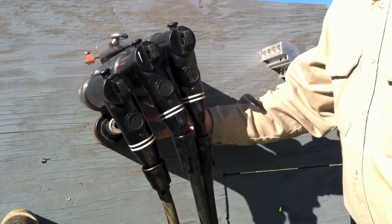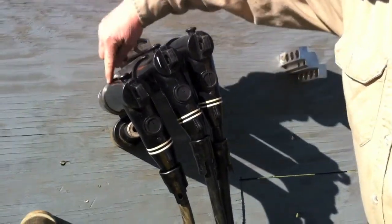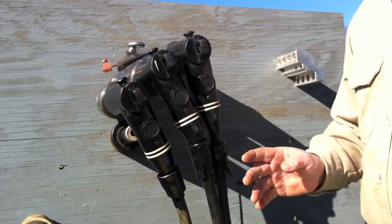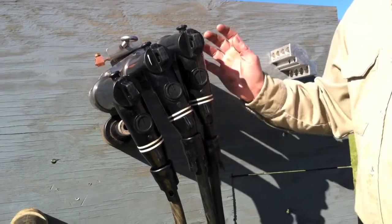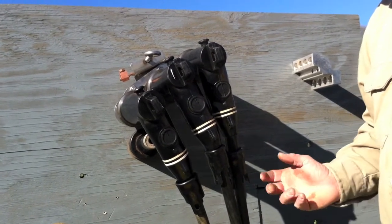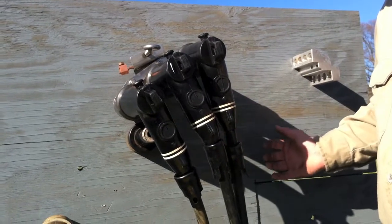Some of the other good points: only having to buy a single bushing transformer is cheaper. Also, another theory that we have and believe is that it's not a problem working with that. We can quit getting fused transformers, which is an added expense to our industry, where you're pulling your bayonet fuse in and out to isolate the secondary side of your transformer.